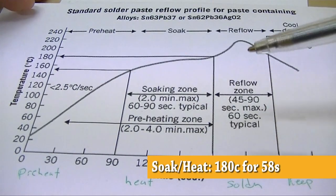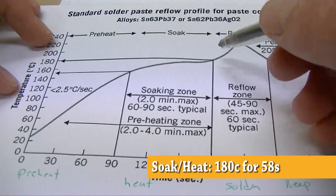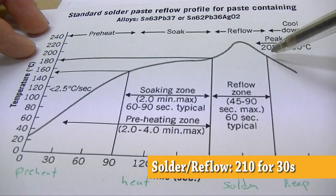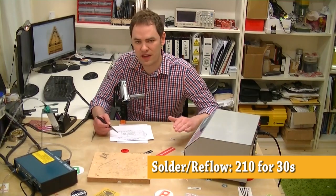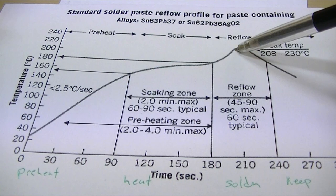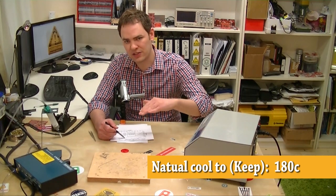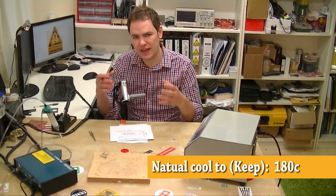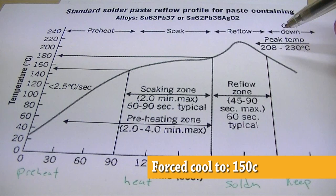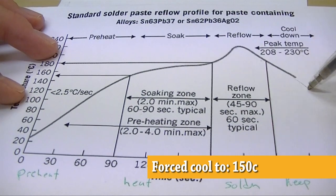Our machine calls this the heat phase, and over about 60 seconds we raise the temperature to 180 degrees Celsius. Then very quickly we raise the temperature up to the soldering temperature, which here they're recommending 208 to 230 degrees. We're using the very low end of that, just about 208 degrees, to keep from scorching boards. After soldering for a very brief time — less than 30 seconds usually — there's a keep period where we let the temperature fall naturally and gradually so the solder can set cleanly. After falling to a preset temperature, in our case 180 degrees Celsius, the fan on the back kicks in and starts a fast cool-down process.